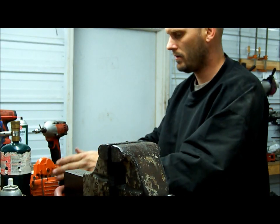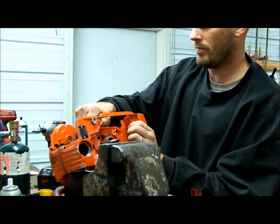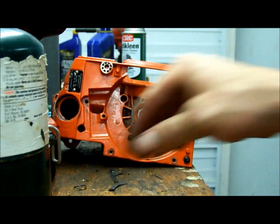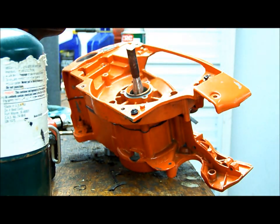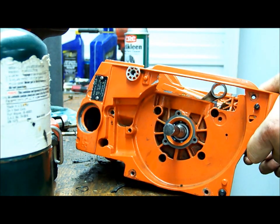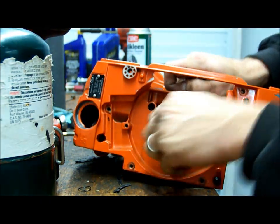Let's see how hot it is here. It won't want to roll over really at all. What you want to do to relieve that — flywheel knocker on this side. Relieve that tension. Tap that side, carefully tap the other side until it wants to roll over.